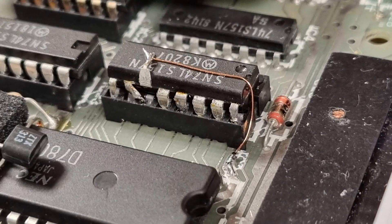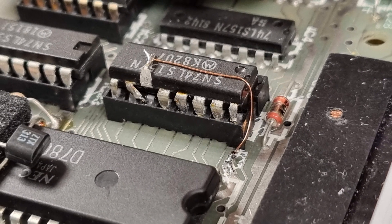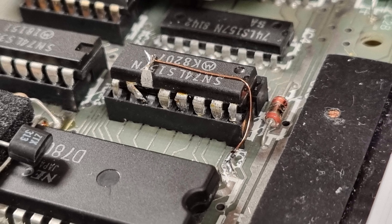So apart from taking the right chip out of the wrong board, this went amazingly well. As for the bodge, during testing I tied the loose end of the floating pin to 5 volts with a bit of enameled wire. That's about all I can tell you about the adventures I had with this machine. I hope you enjoyed my terrible mucking about, and I look forward to seeing you in the next one. Goodbye!